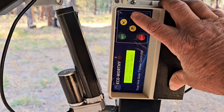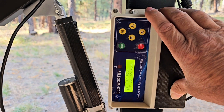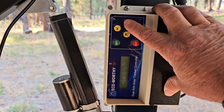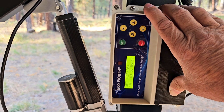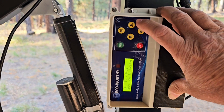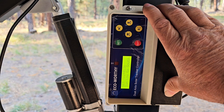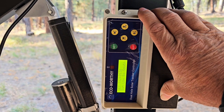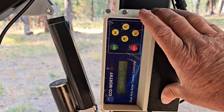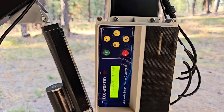T10 is from east back to the position you want it resting at — that's the critical time to enter. Mine took 15 seconds to get back where I wanted it to be. T11 is from the furthest south to the furthest north position — enter that time, and I added a couple of seconds to it as well. T12 is the return to the angle that you want it to be at — mine is set at 13 seconds. Once you have all those settings programmed in, that's what you need for the low light return. Press the quit button to go back to the main menu and save.